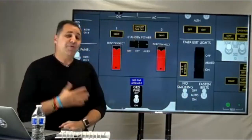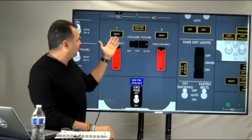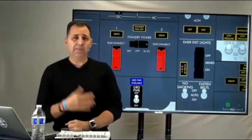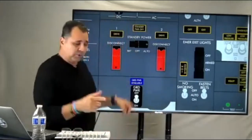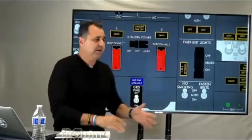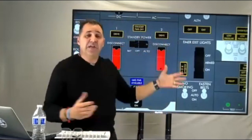If the drive light comes on, how you answer depends on what you know. Remember, the drive light is normal to see when the engine is not running — it's normal because the CSD is not turning. The engine is shut down, there's no oil pressure. Once you crank that engine, you start building oil pressure, everything works — CSD, generator — and that drive light should go off.